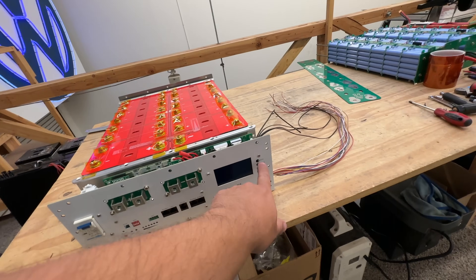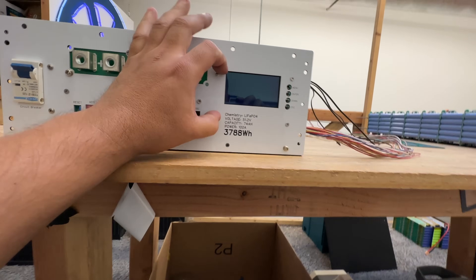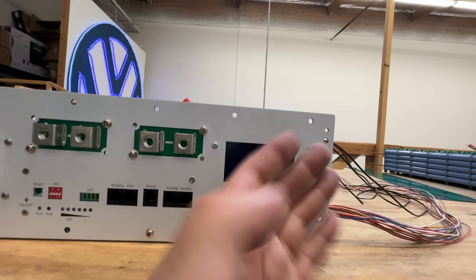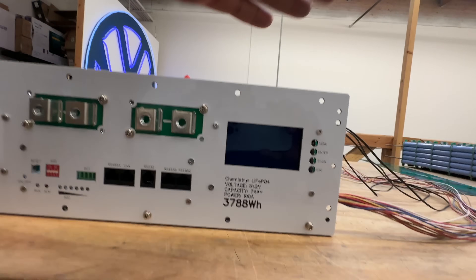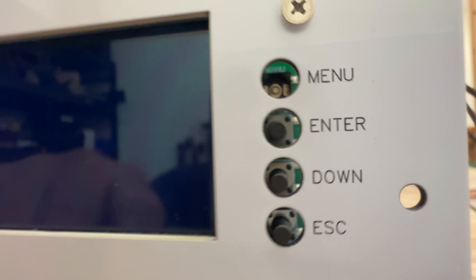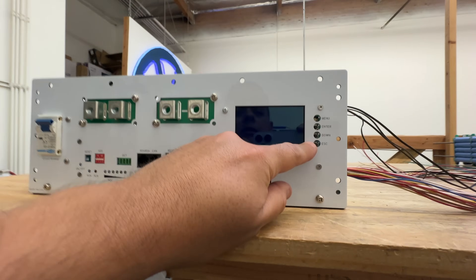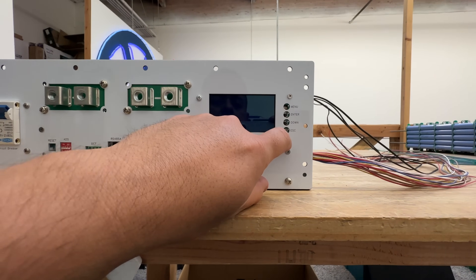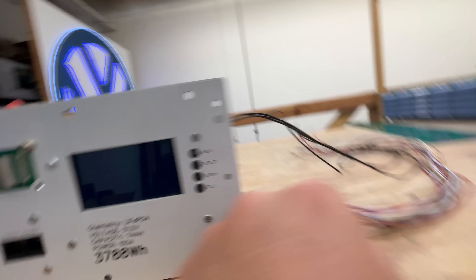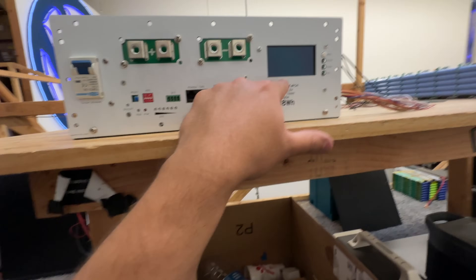On this side I made an error — the measurements weren't completely right. The enclosure is asymmetric; I had the design backwards when specifying the bend direction, so the screw holes ended up slightly off. I've adjusted the dimensions now so those holes are exactly centered, and that allows me to fit the two little buttons into their corresponding holes properly. Now you'll be able to put the button in and it'll look a lot more finished.